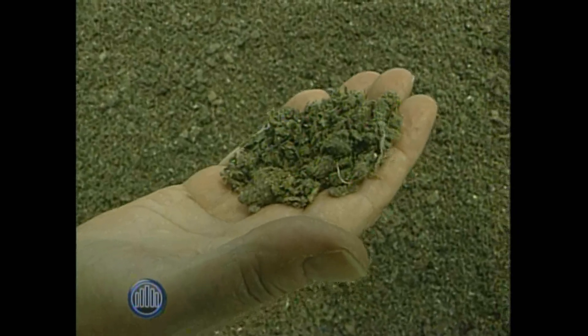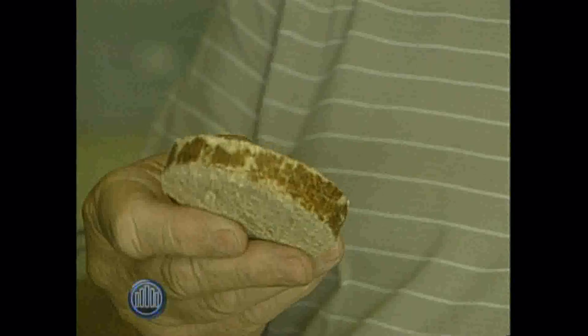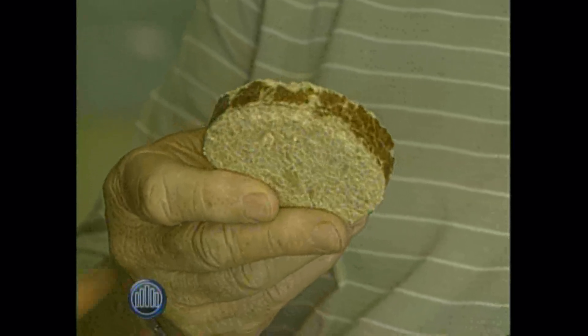Wax cardboard is another constituent of the waste stream that cannot be recycled — it's what our vegetables come in at grocery stores. The beauty of wax cardboard is that it has a very high BTU value. Most biomass is between 8,000 and 9,000 BTU per pound; wax cardboard is closer to 11,000 BTU per pound. What you're looking at outside in those three piles is a mixture of products — feedstocks for our industrial briquettes. This is used for industrial and large commercial boilers that normally burn waste wood or coal. We can substitute this fuel for those fuels, improve the emissions, and reduce the carbon footprint by up to 90% — and we're using recycled materials.